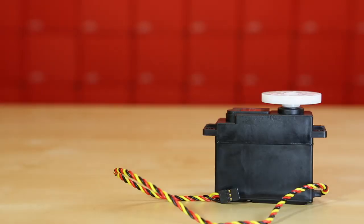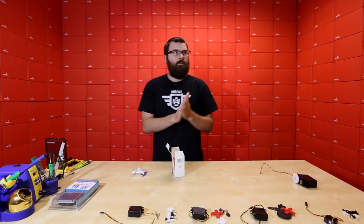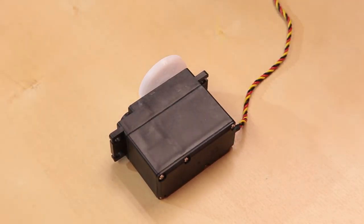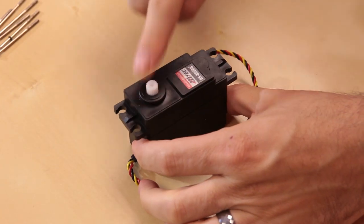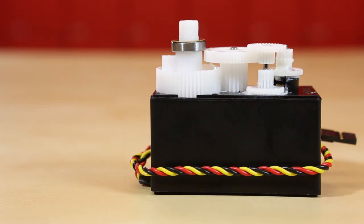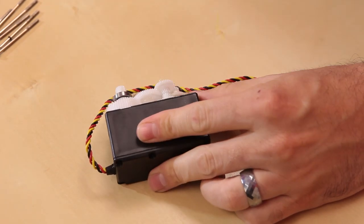Lastly, we've got the one everyone's been eyeing — the HS805BB. It is big. Compared to the previous servos with 46 to 76 ounce-inches of torque, this one delivers 275 ounce-inches. It draws about 800 milliamps while operating, so you need to rethink your power supply. It has a plastic spline and plastic gears, but they're actually quite large and beefy. And you can clearly see the ball bearing up here — it sits right in the top and gives the output shaft stability against the outer case.